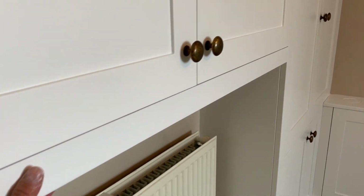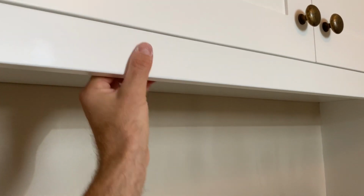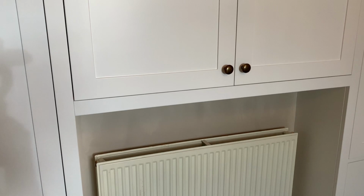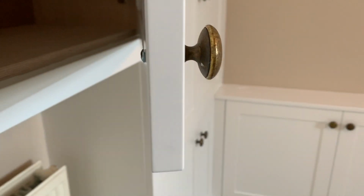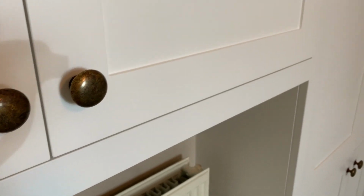I think the important thing is just to make, however you fix them, just to do it well and to make it solid. So this piece that just sticks down from there and has been fitted at the end, it's very solid. We strengthened it with some support blocks there, but it is dominoed into the lip there, and there's really no movement on it. The method allows us to get a particularly high level of finish on the doors as well, because we're not trimming doors into the frame. They can be pre-finished with these very smoothly rounded arrises that we do and a very fine sprayed finish, which would be, well, a lot more work to achieve if you were fitting a frame, trimming doors to it, and then having to paint after.